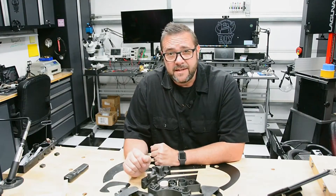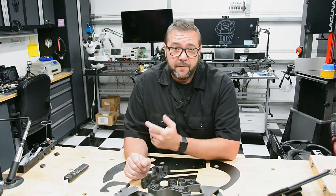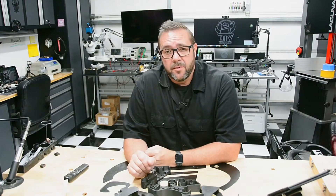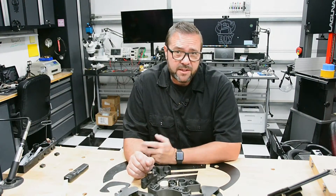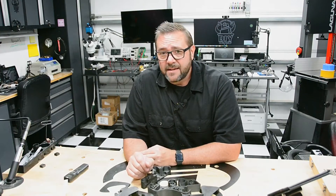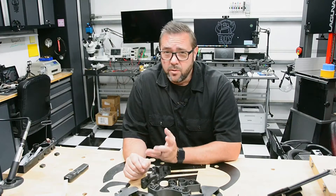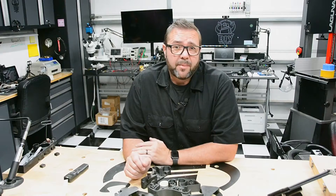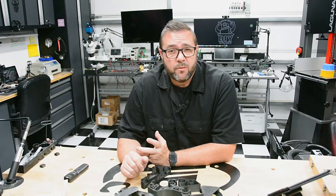In the last video I covered designing machine enclosures and user parameters in Fusion 360. I've been performing lots of upgrades on my Shapeoko 3 — in summary I've upgraded the limit switches, the V wheels, Z-axis, added a new 2.2 kilowatt spindle, the cooling system, and a brand new dust shoe. I figured while I had it out of the enclosure it was a great opportunity to make all of these improvements.